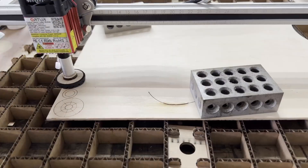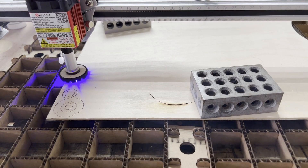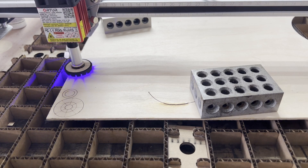Added bonuses are that it keeps the air assist air in where it needs to be and makes for a cleaner cut. Some of you are going to say you don't want something dragging on the surface of your cuts — I understand that, so make the EVA foam skirt just a little shorter and lift it up. The other thing is it might hit uneven surfaces and drag, but that is kind of why I made the cutout to have little tiny fingers. It might not necessarily be in your best interest to have the skirt — sometimes it's just to have the disc. There are also people who want that tiny dot to line up all of their laser cutting and engraving, and if that's the case, this isn't for you. But for the vast majority of stuff that I do, I don't locate things by that dot — I locate things by giving it a test cut and seeing what happens.